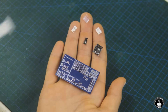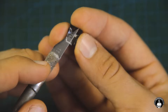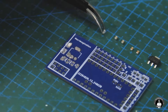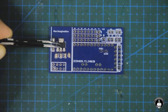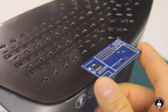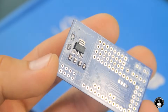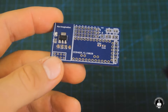Once you've received both boards, we can begin soldering the surface mount components with soldering paste onto the camera unit's PCB — a blob of paste on each pad. We can place the power LED, current limiting resistor, 10 microfarad and 0.1 microfarad capacitors for power filtering, and the 3.3 volt voltage regulator. I'm using a clothing iron to solder these components onto the heated board, though it's not recommended. If you're going to heat them with solder paste, either use an iron with adjustable heat up to 200 degrees Celsius or more, or use a proper SMD hotplate. Now let's repeat this for the head tracker transmitter's PCB and solder its surface mount components.